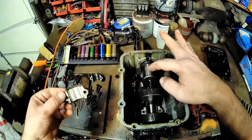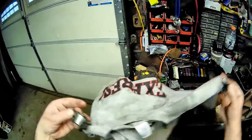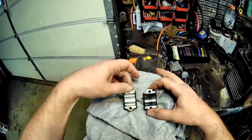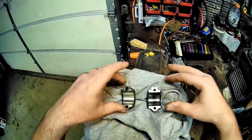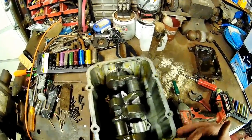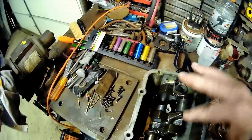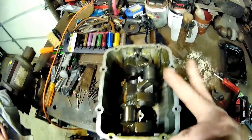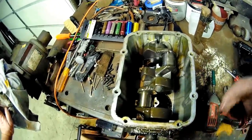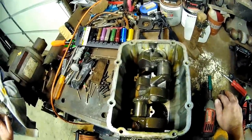Chances are, like if I just wanted to get another connecting rod, it probably would last a while, but Jeffro gave me a new one, so why would I bother doing that? Definitely a little bit of a difference there. I can't believe there's no crank vent on this at all that I could see — I don't see any holes for venting, which is probably why a little bit of air gets by those cylinders and blows this seal out and pushes the oil out. Now this new one has a vent tube right there.